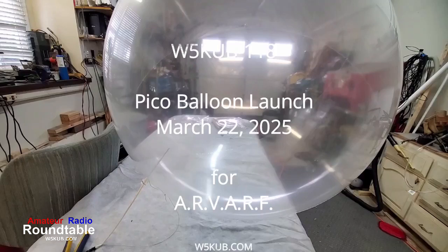There are only a couple of balloons out there that will work. You've got to have a balloon that's not stretchy. It can't be latex. It can't be a weather balloon. They're made to destroy themselves as they go up. These balloons are 1 mil, 1,000th of an inch thick, and once they expand out to their volume, they don't expand anymore. Once that happens, the balloon stops rising, and that establishes the float altitude.